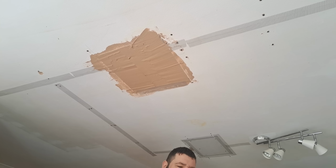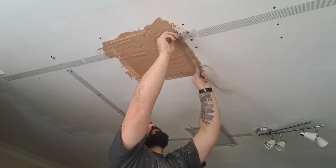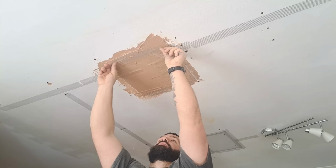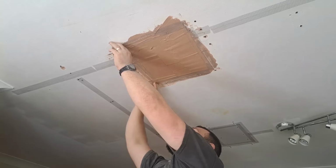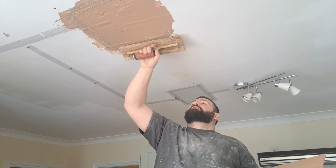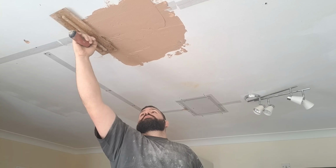Nope. Don't push them into the finish because then you have the same situation again. Just sit them on top of it. Just touch the finish and they'll stick to it. Now, does that make sense what I've done? Whenever you try and put scrims on something that's two different levels, the edge of the scrim will keep lifting up and sticking out of your plaster. So I've filled the hole out flush with the ceiling, and then my scrims will lay on it flat without kicking up.